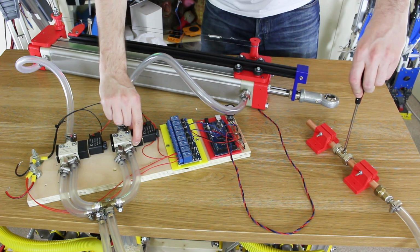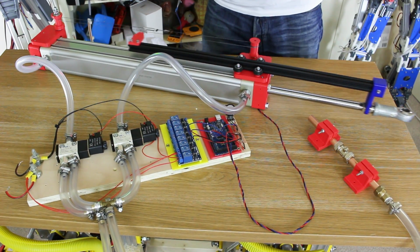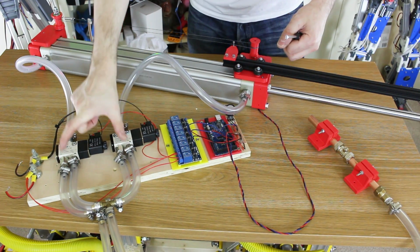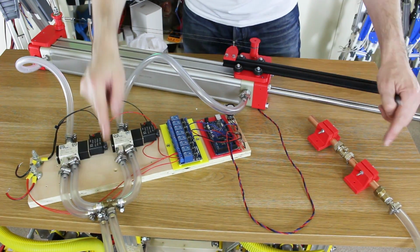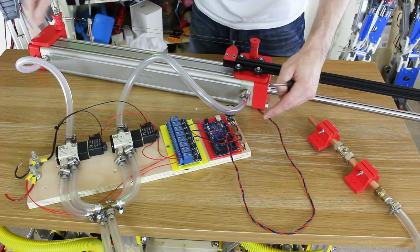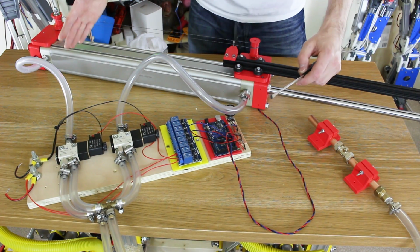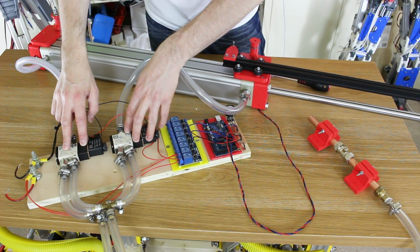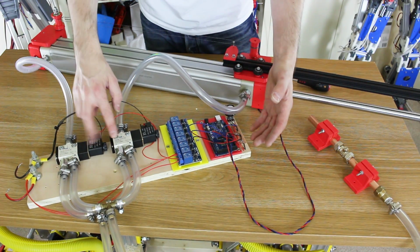So now if I turn them both off, we still get the creep. And that's because now these solenoids are both off. Both the releases are connected through this T-piece, which is connected to here. So now air can still go back through the T-piece and back into the other side, into the higher volume side. So obviously if we did have the proper valve, when they're both off, it actually locked air in, that wouldn't be a problem, but we haven't.